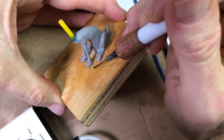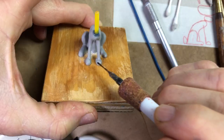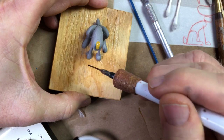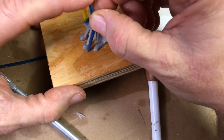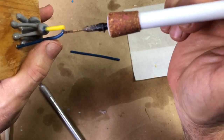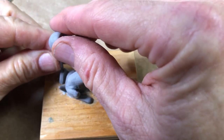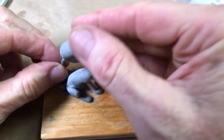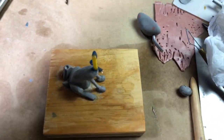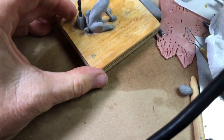When I cut this mold open, I'm going to cut it along this leg, around the shoulder, and up this flume of the neck, and across in between the legs — so the parting line is going to be this kind of complex thing. I want to put one more vent in this model, and by attaching it to the end of the neck it will allow the resin to flow all the way to the bottom. We're also going to make the head of the rabbit in this same mold — the whole point is to save as much rubber as possible. The more parts you can gang into a mold, the less rubber you use. This rubber is expensive, so making gang molds is a great way to cut down your costs.